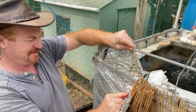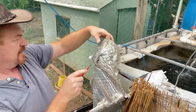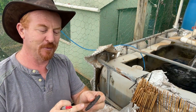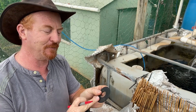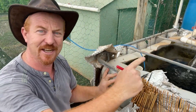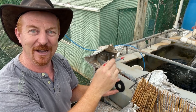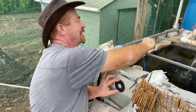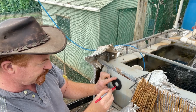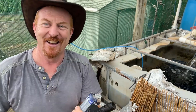Now that I've taken the insulation off, you can see the water level there. I'm going to put the bulkhead fitting a good two centimeters above that line — I'll use the rubber from the bulkhead fitting as a measurement guide. The water level is about 10 centimeters below the highest point, or 8 centimeters below the lowest point over there — that's where I get the two centimeters from. I'll draw a circle and that's where I'm going to drill.